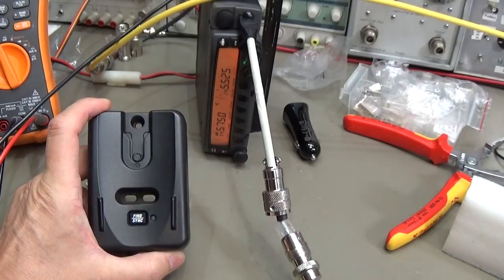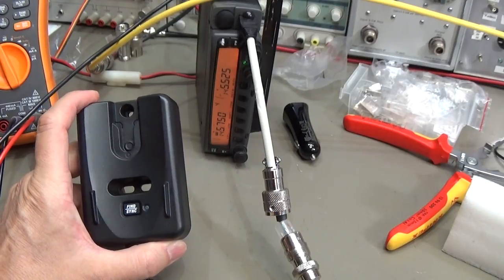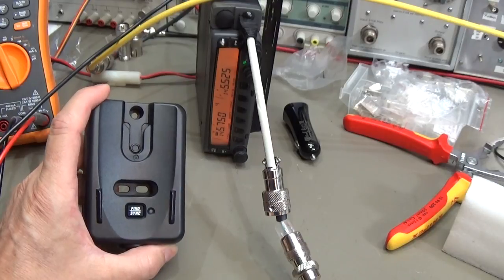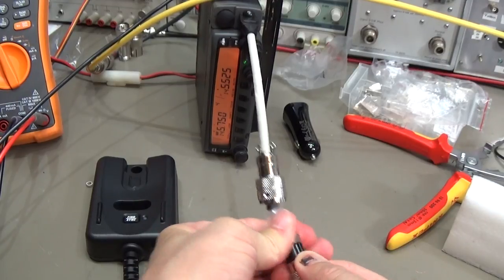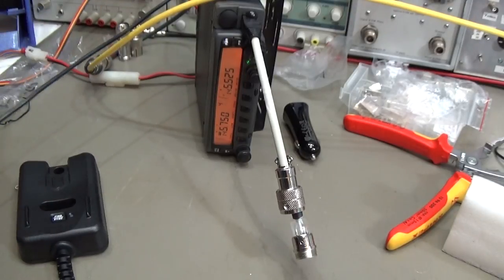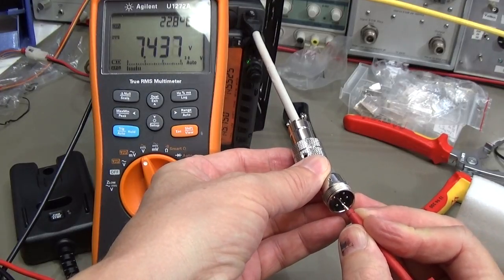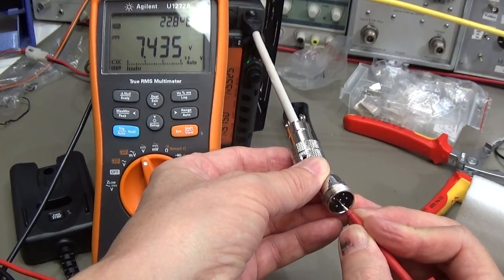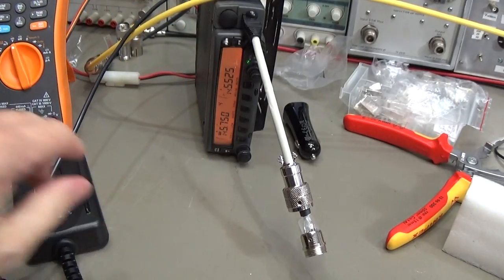So we do not get our flashing LED, which can tell us that something is wrong. So maybe our voltage is too low, which is what we had already expected. And so let's check what we have. But that is not wrong, we have our 7.4 volt, so that is obviously not our problem. It means that most likely our circuit, our cradle, is not working with this low voltage.